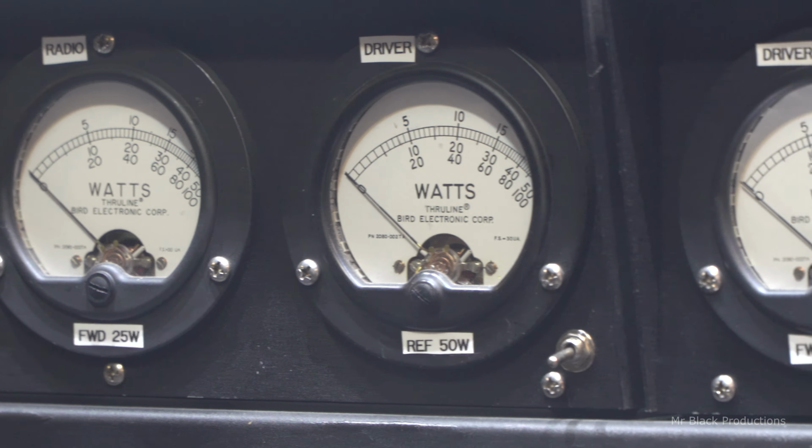Took all day yesterday screwing around with a stupid regulator, but we're at 15.1 rock solid at the alternator. The dash reads 14.9, and back here it's going to volt out at about 14.9. So underneath the load, internally inside the box, because there are so many losses between all the different connections under operation, it'll probably drop to about 14 volts, which is perfect. You've got to figure you're going to have about a volt, maybe a volt and a half worth of loss over this distance, even if we ran heavy wire.